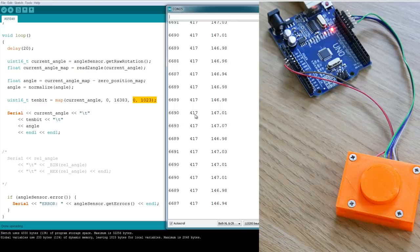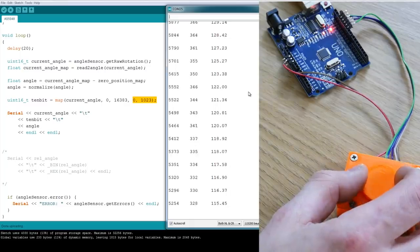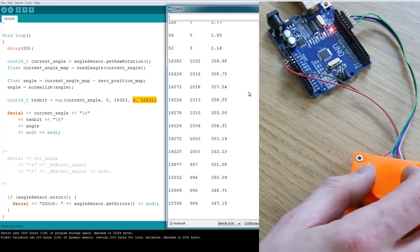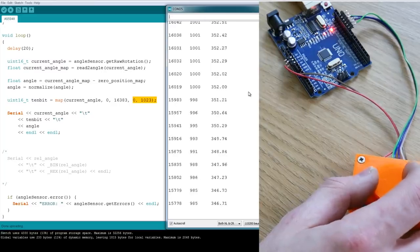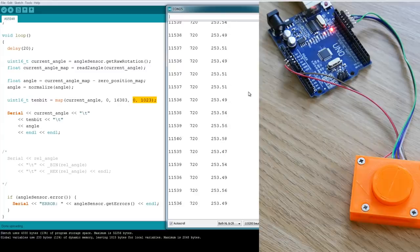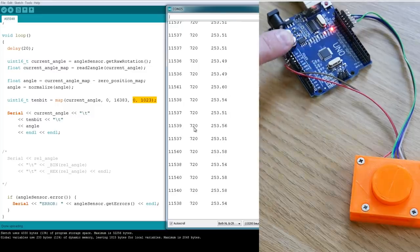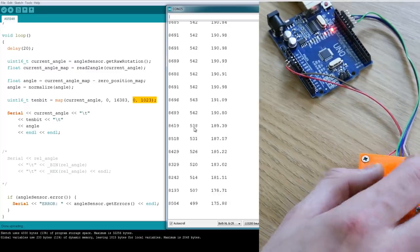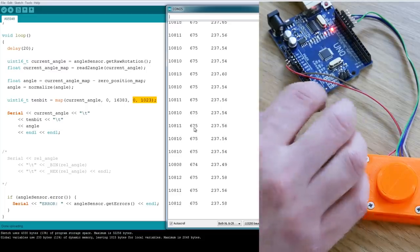When I open the COM port you'll see why. The first column is the raw encoder data, the middle column is the 10-bit value, and the last value is the angle. If I turn my orange knob we can see those values changing. We can turn it all the way up to 16,383 just before it wraps over. The middle value goes up to 1,023 as it would with an analog pot, and the angle goes up to 360. There's still some jitter at the 14-bit value, and the jitter in the angle column is in tenths of a degree. But the 10-bit value is rock solid - and compared to a 10-bit analog pot read into an Arduino, we still see more jitter on that. So that's actually a really rock solid value.